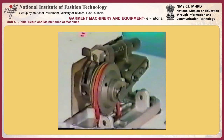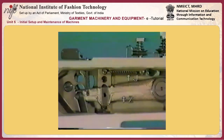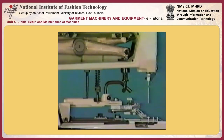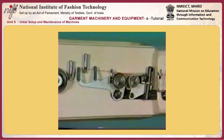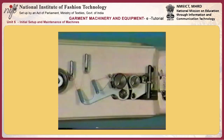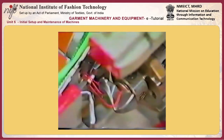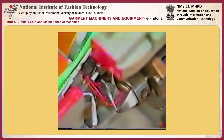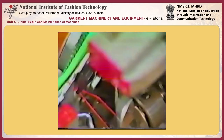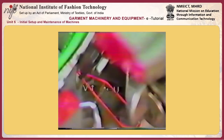Pulley enters the stop motion state by coasting. When the lifting plate comes down, nipper bar J and lifting lever Z move. Button clamp H goes up. Nipper F clamps the thread so that the thread on the needle is not fed, and stitch adjusting lever E slackens the thread to prevent stitch skipping at the start of sewing. Thread separation nail U of the moving knife separates the thread, and moving knife B and the counter knife trim the threads. The machine operates in this way.